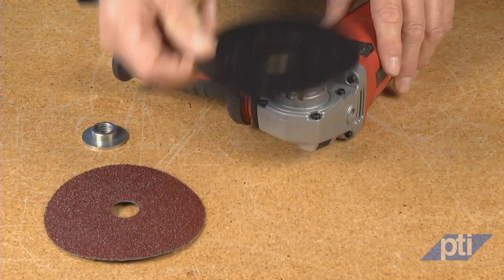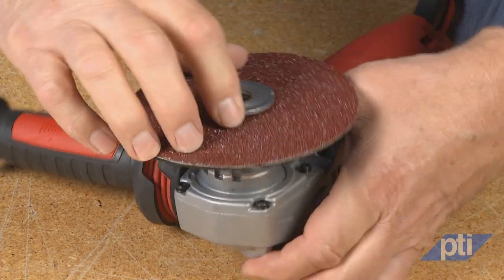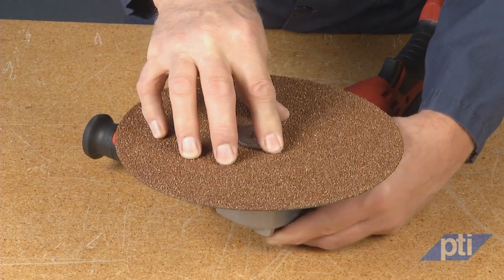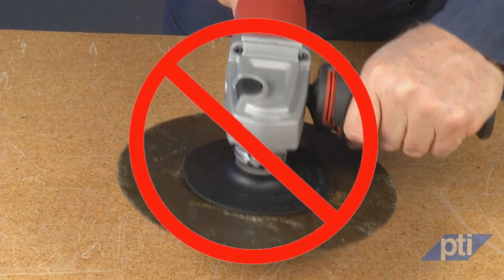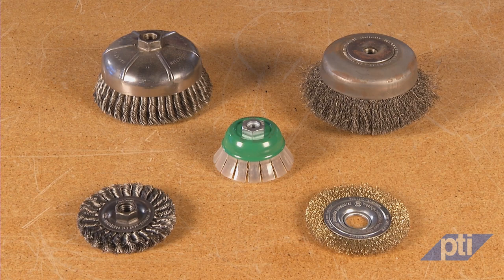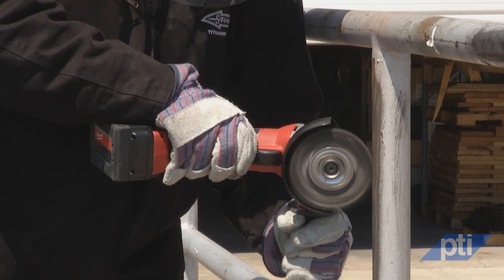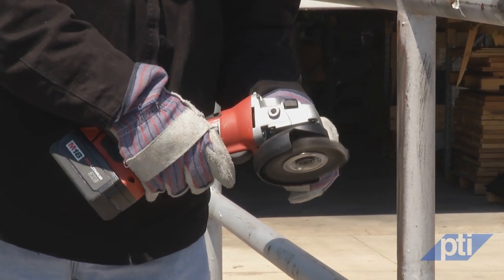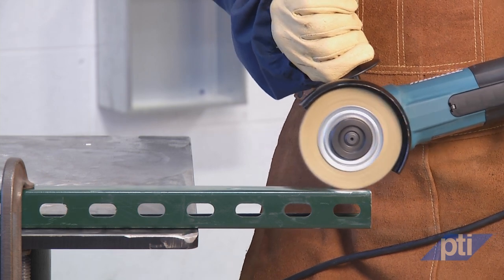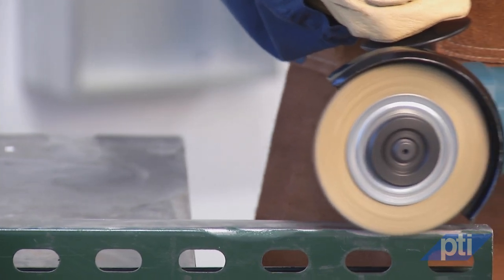Another application for angle grinders is sanding. With the proper backing pad, some angle grinders may be used for sanding and brushing applications — always check with the manufacturer and follow their recommendations for proper configuration and accessories. Do not use excessively oversized sanding disc paper, as sanding paper extending beyond the sanding pad represents a laceration hazard and may cause snagging, tearing of the paper, or kickback. When performing wire brushing applications, be aware that wire bristles are thrown by the brush even during ordinary operation. Do not overstress the wires by applying excessive load — wire bristles can easily penetrate light clothing and skin. If a guard is recommended for wire brushing, do not allow any interference of the wire wheel or brush with the guard, as the wire wheel or brush may expand in diameter due to workload and centrifugal forces. Always verify and follow the manufacturer's recommendations.